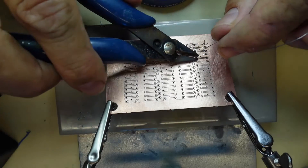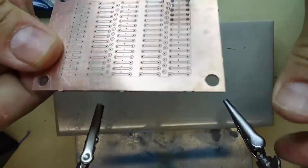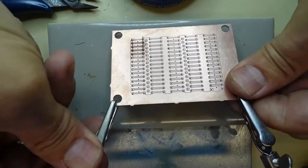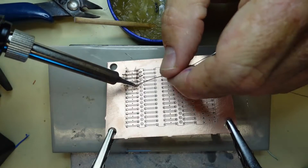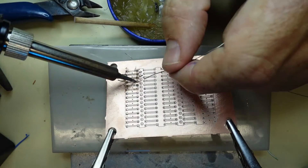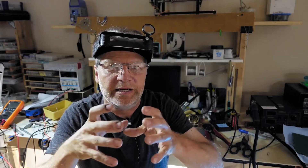You snip this above the blob, and now you have a single wire that's soldered together. You do the whole top side like this, then you flip the board and now you have a centimeter or so hanging. When you heat up that joint, it'll actually pull some of that solder down onto the joint — you probably need to add a little bit — and you're done.